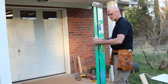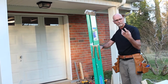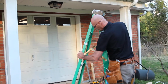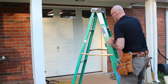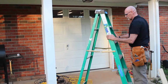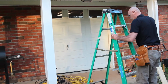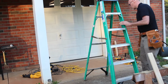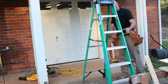So I'm going to open this ladder and I'm going to go up this at an angle just because we're filming. I want to show it that way so you guys can see what we're doing. So to open this ladder, we slide open, and then there's 2 lock points. And make sure you lock them down and stabilize it. Now when I look at it, not stable yet. I'm going to actually put this ladder on flat ground, and I've got a slight uphill climb. So now I'm sitting nice and flat. I'm on a fairly level surface here that I'm working with.